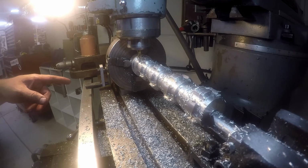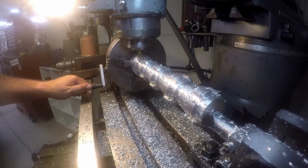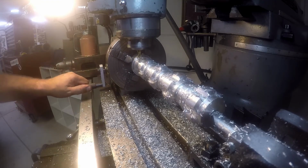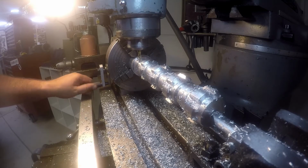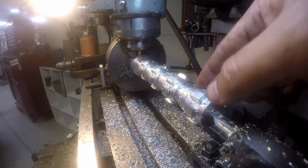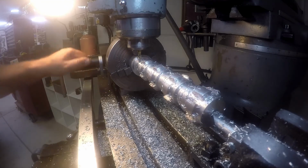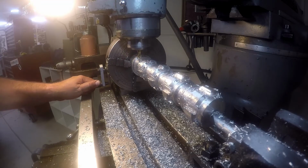Run my 10 rotations on here, which I need to go the other direction though now. So let me see, I'm gonna do my 5 rotations. 1, 2, 3, 4, 5. All right, so now that put this guy right here back on dead center at the top. Now to keep going. 1, 2, 3, 4, 5.